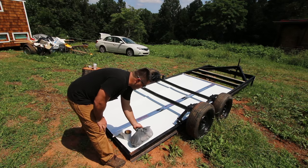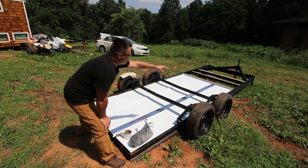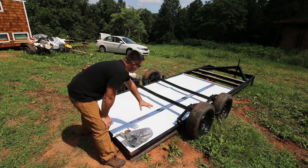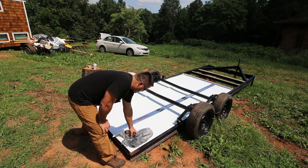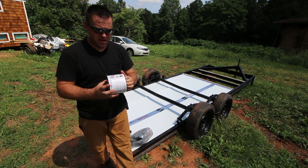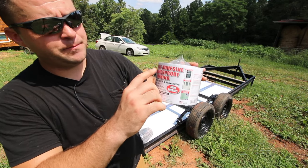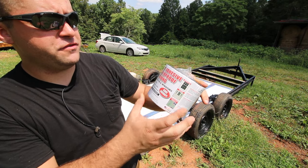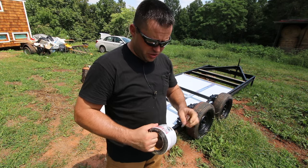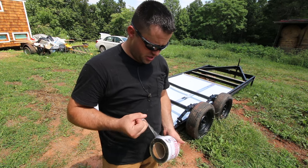Before I put all the screws into the aluminum, I'm going to tape all the joints. I noticed earlier I had screwed it and then taped over it, and you end up with air pockets. So I can tape it first. I got the same tape I used for my windows — Original Tight Seal, self-adhesive, waterproofing flashing for doors and windows. It's really thick tape — I'd call it flashing. Nine dollars a roll, so that raised it up to $30.